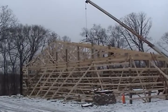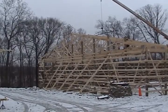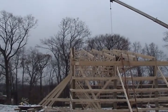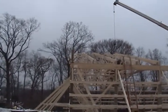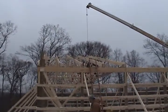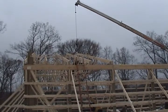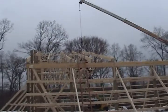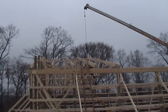We've got to set the trusses and we're bracing them in about 15 different places. If you don't do this, you're risking a death. You have to have your gable truss really, really braced well with the A-bracing at every pull. We're 4 foot on center and running about 12 stringers a side as we go — it takes more time but it's well worth it; it keeps the danger out. If 80-footers bend and you don't bridge them, you've lost all load capacity and they'll collapse on you — they'll break right at the gussets.